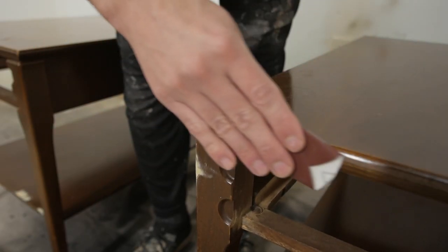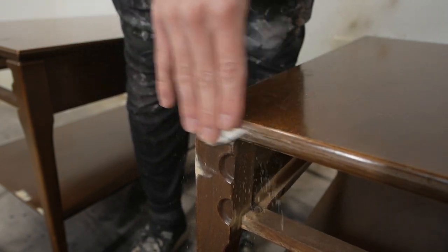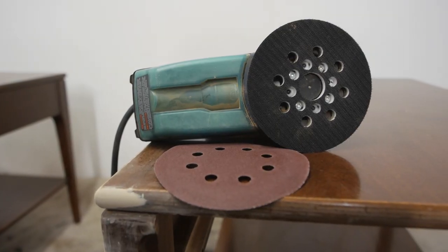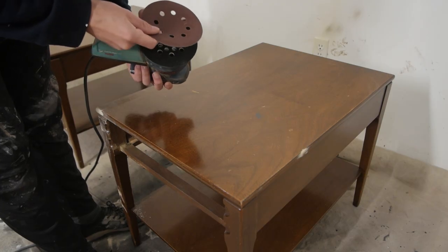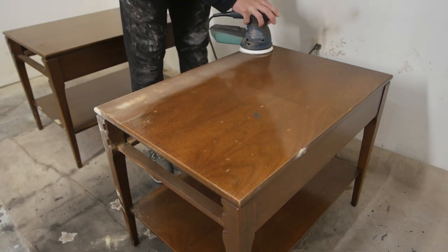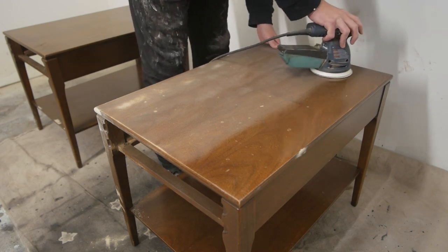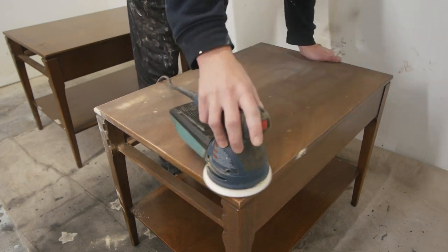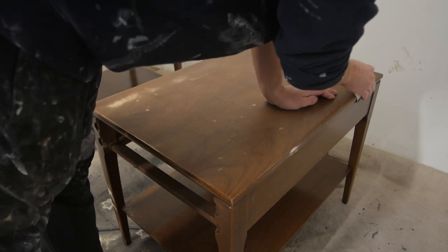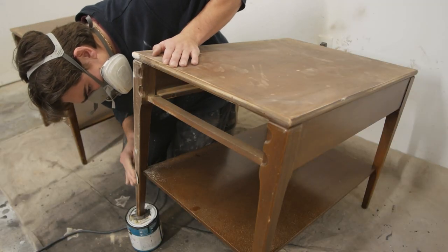After a good night's rest I came back and started sanding the wood filler smooth. When sanding wood filler I usually grab a high-grit sandpaper — here I'm using 400 grit — so I don't go through it too quickly and I can shape it the way I want. Then I grab the random orbital sander, starting with 120 grit and going up to 220 grit. There was another spot on the edge and a few more scattered throughout, so I had to take my time.